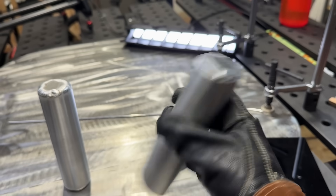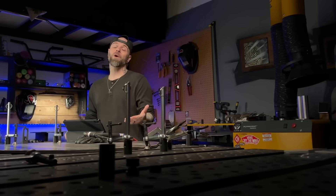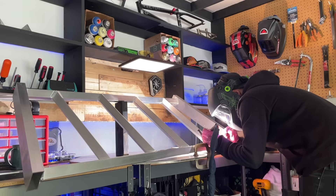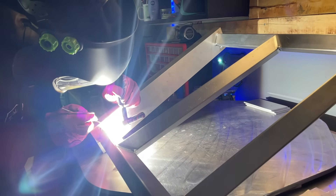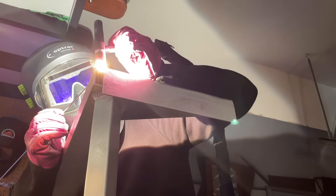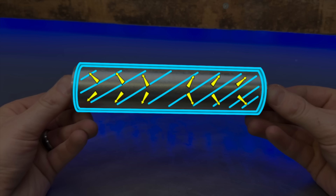There are a few different ways to describe this problem, but we obviously need to fix it. And it actually happened before we even struck up our first arc. We need to start over and prepare the same piece of pipe and end caps differently. Whenever we are welding something, we need to be aware of possibilities like this — identifying areas that can overheat easily. This could dictate where we put our tacks when assembling the joint, where we place our stop-starts and welds, or even the direction of our welding passes. Knowing this is a sealed compartment, blowback is a severe possibility that you need to deal with.